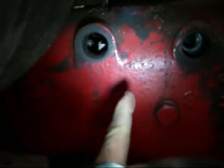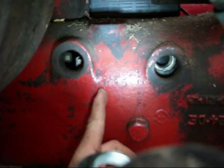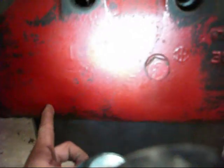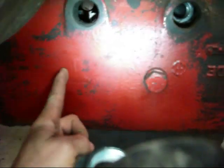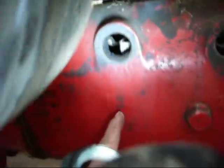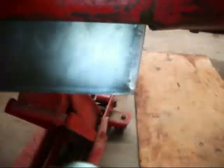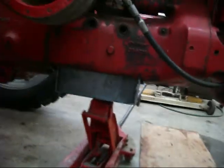Like, that's why it's got that L-shaped profile to it, because the original belly pump was only 10 inches long, and this pan is 15 inches long total. And then it goes up and takes a step back 5 inches, so the front of it's the original 10 inches, but then I got the extra 5 inches of capacity back here. And you gotta have that L there for the coupling and the drive line back there. So anyway, that's how it's gonna look.